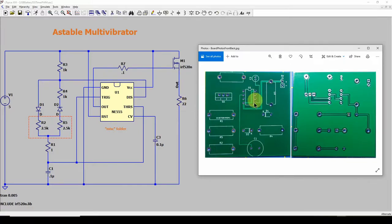Does the printed circuit board care if this is a 22 ohm resistor or a 1k resistor? No — it couldn't care less about any electrical characteristics. It just needs to know where to drill the holes. What else does it need? It needs data showing what terminals of each device get connected — for example, R6 needs to be connected to the source of the MOSFET. So it needs the physical configuration of each component: the dimensions, the location, and for each pin, what to connect it to.